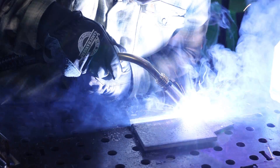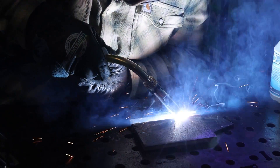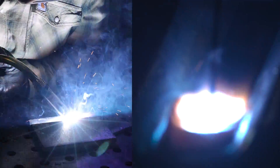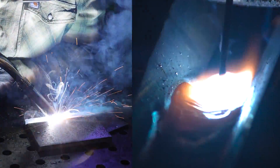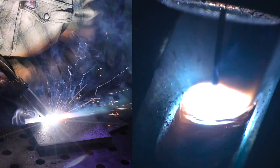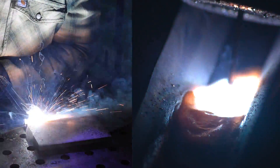While I'm putting this root in, I'm oscillating back and forth to make sure I'm tying into both bevels and have complete fusion, because when we go to destructive testing, this is one of the most important parts of your weld. I have one chance to make sure this weld punches into both bevels for proper fusion. While doing the root, you don't want to spend any time in the middle — watch your puddle wash over to each side and continuously move forward while the puddle washes into each bevel. I'm able to achieve bevel-to-bevel coverage by doing a slight oscillation with a continuous move forward.